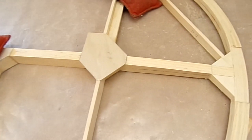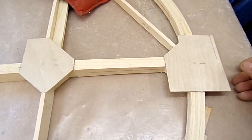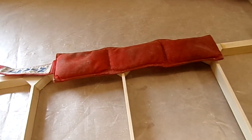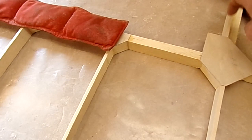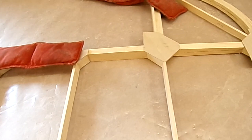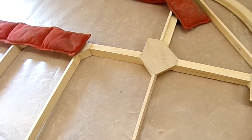The upper gusset is pretty conventional. You might also see that I've got packing pieces under here and weights on the front rib — a packing piece clamped, a weight on the spar — and that's to keep the spar dead level at 90 degrees. The front rib is correct in relationship to the spar, and this stops any chance of flexing with the trailing edge bow to maintain everything in its correct position as I put weights on and get the gusset set. When I turn the rudder over I'll do exactly the same thing so it's jigged flat.